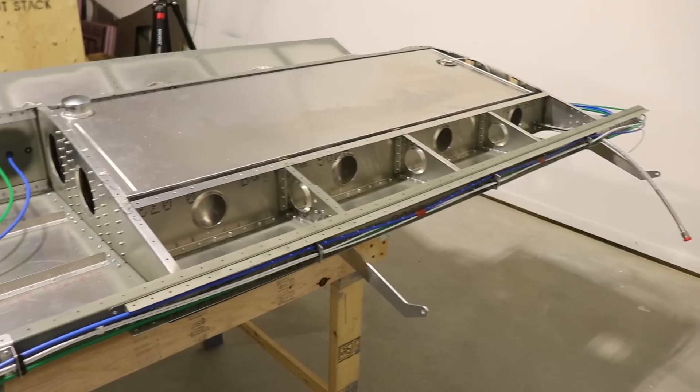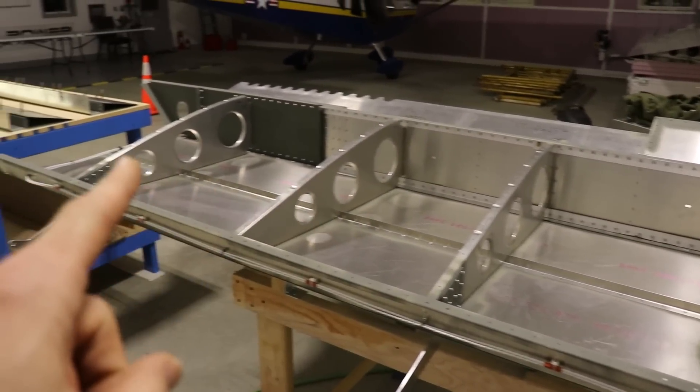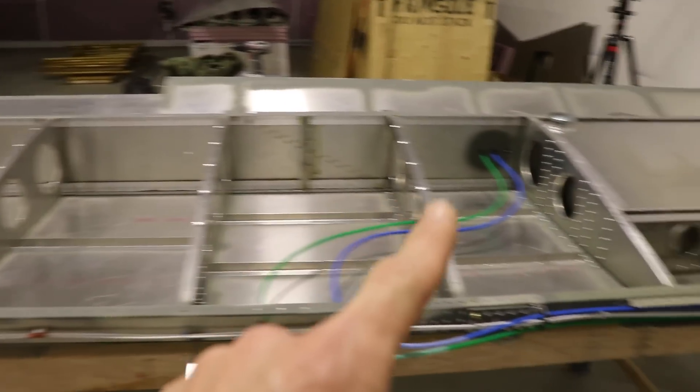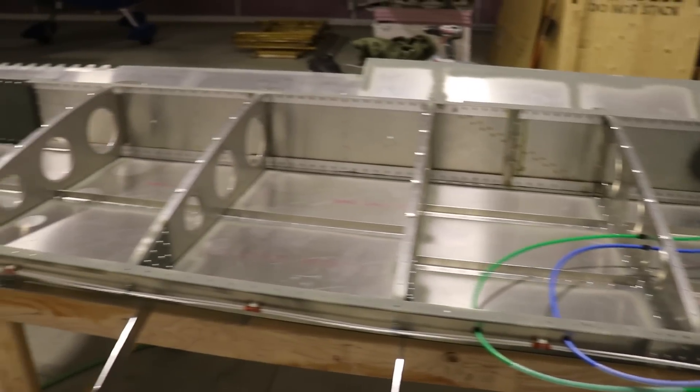The only thing I have left to do is run the three wires from the pitot heat controller — a positive, a negative, and a signal wire for a status light on the panel — through the spar bar and down to the fuselage. I ordered the wire from Steinair today. Once I get that wire routed I still have holes to deburr on the skins, then I can rivet on the skins and this wing is pretty much done. After that I'm moving on to the wing tips, finishing up the flaperons, and then onto the fuselage. Hit the thumbs up, subscribe, and see you next video!